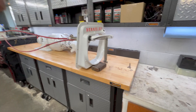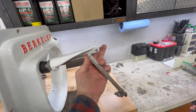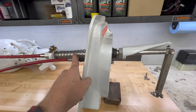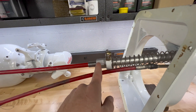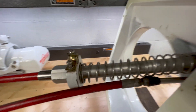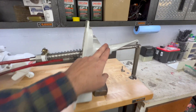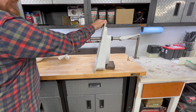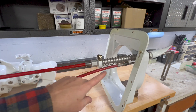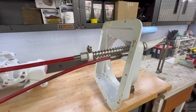Lastly, to get the steering linkage on, there's an extra bar and bracket system — we'll fish that through and throw in this cotter pin so it doesn't fall out. You can see here: this is still our steering control — the cable that runs on the inside of the Bowden cable — and this is our jetovator trim control, which runs on the steering tube. But the steering tube is essentially attached back here to the steering cable. So the way this functions: to adjust the jetovator, it pulls and pushes the steering cable in and out of the transom.